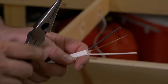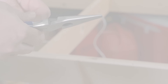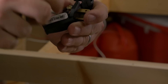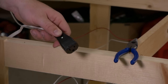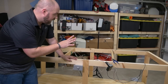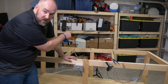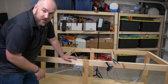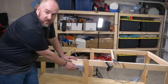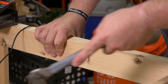Next was each end of the wire — I'm essentially making this into an extension cord. I stripped off the ends of the wire so I can install them in the little terminals in the plug cover. I made a male end on one side and a female end on the other. We have everything wired up, and I currently have the plug plugged into one of my video lights. I've got the on-off switch in the off position, so let's go ahead and throw it to the on position — and look at that! The light comes on! Finally, I installed a power strip and some cable clips for future wire routing.